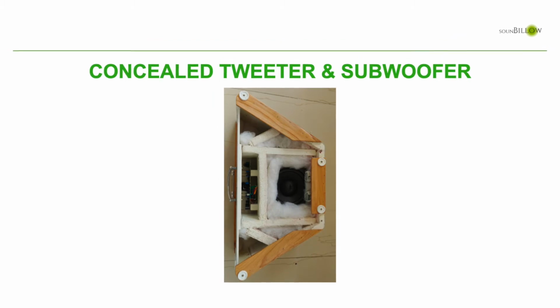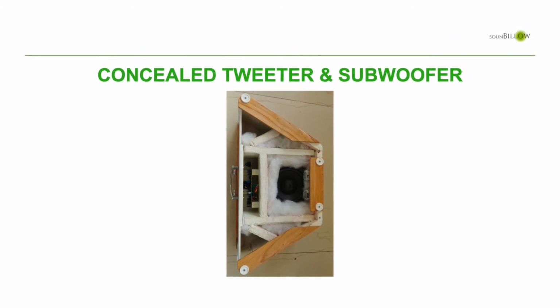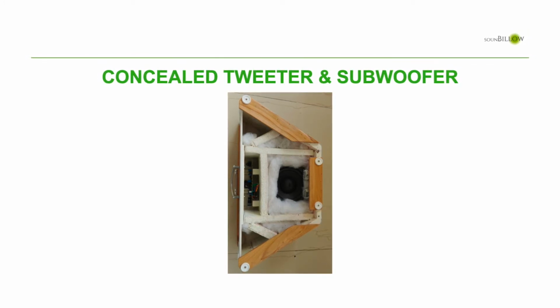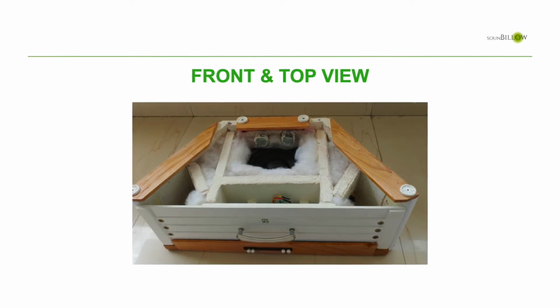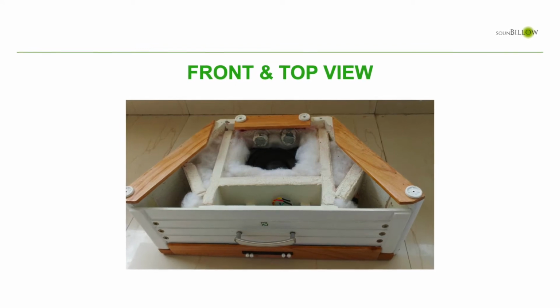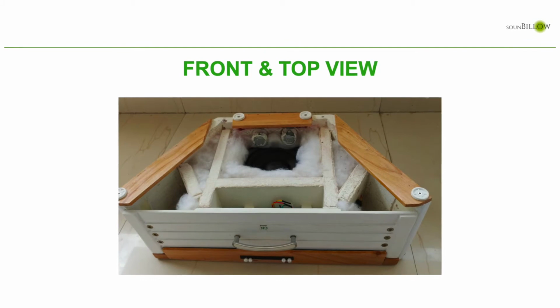Concealed chamber design with two ventilated pass pipes. The back and front subwoofer chambers are designed empirically, and no theoretical techniques or calculations are used. Nevertheless, the response of the subwoofer is smooth, with heavy pumping proportional to the signal level strength.